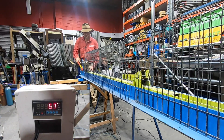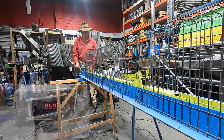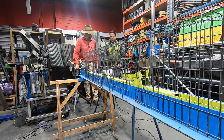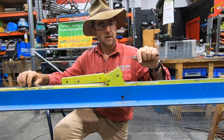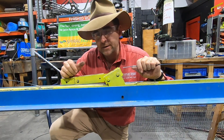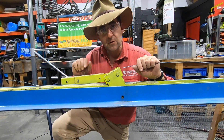Crimp time. We're doing all right — 492-ish. So we've gained 100 kilos over the knots and the Gripple with the crimp. Easily 100 kilos. It was definitely the crimp that gave way — the wire has literally pulled out of the sleeve, and you can see the wire that got pulled out has been polished. Really impressive job — that's up close to 500 kilos. The breaking strain of the wire is around 600, so that crimp's doing a good job. By so far, it's the clear winner.